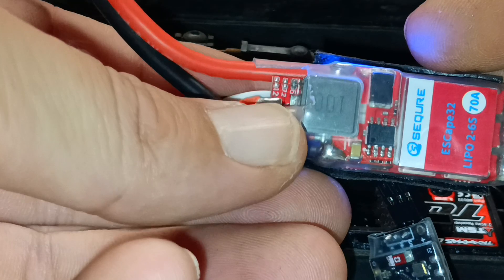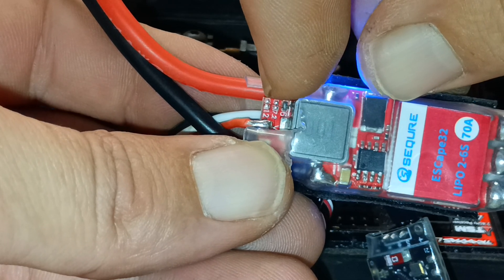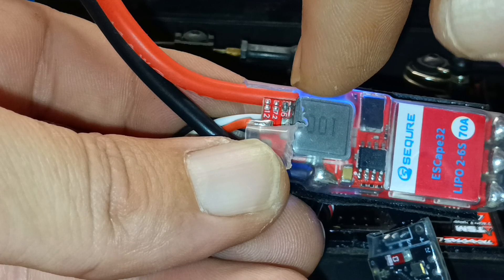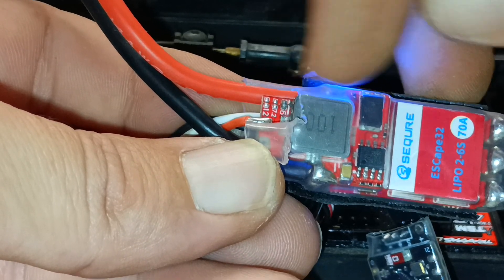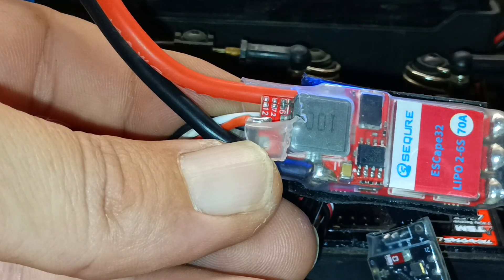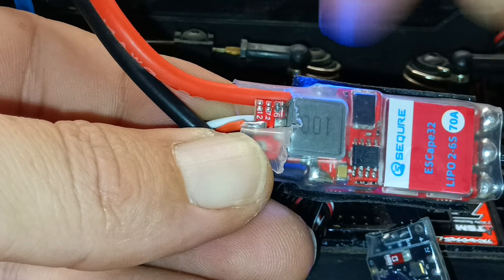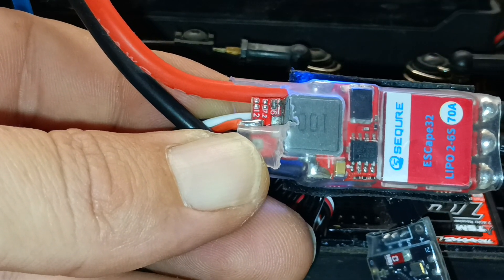I've had to cut this little piece away so I could solder, but basically you've got these three little tabs. One says 6 volt, one says 7.2 volt, one says 12 volt. To use 6 volt you only solder that one together — because my servo is a 6 volt servo I've only soldered that one. If yours is 7.2 volt you solder the middle one. If yours is 8 volt you solder the 6 and the 7.2 volt together. If you're running a 12 volt servo and you want that extra power you solder all three together. It's really easy to use and easy to set up — if you're not experienced at soldering it's going to be a bit tricky, but I've only been doing it for a few years and it was relatively easy to bridge that little joint and get it to run on six volts.